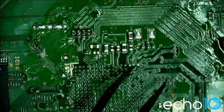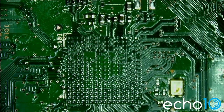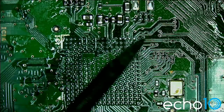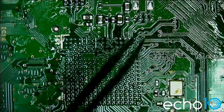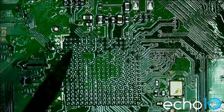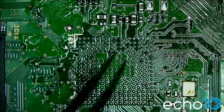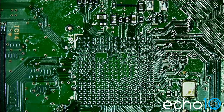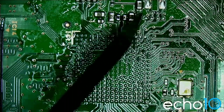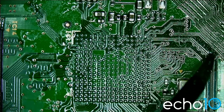So I bet if you looked at the R16 docs, those top two right pins are probably USB, D plus and D minus. Judging based on the corner, I would even say D zero plus and D zero minus. But otherwise everything looks basically the same. I'm not even going to try to remove this and judge based on that. It's not worth it. But just the fact that this crystal is in the same place, this crystal is in the same place, and I'm pretty sure that the USB is in the same place, I would say that's probably a good bet.